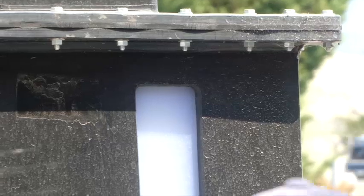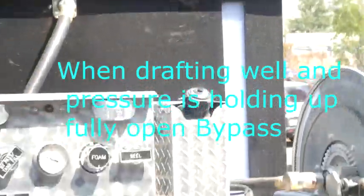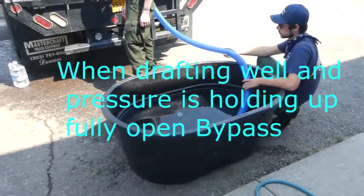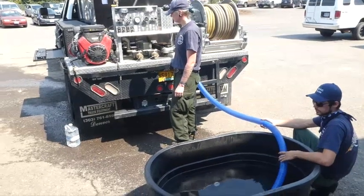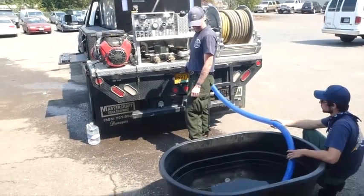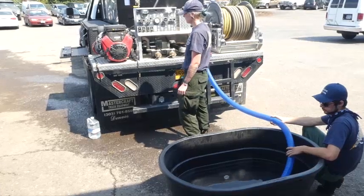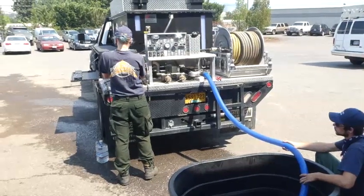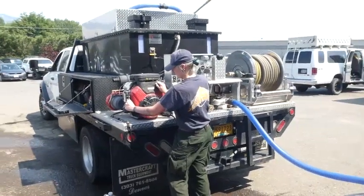Check to see if your tank is filling. When drafting well and pressure is holding up, fully open the bypass. You can use your bypass before shutting off your pump when you are done drafting.